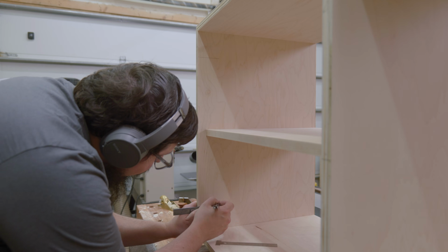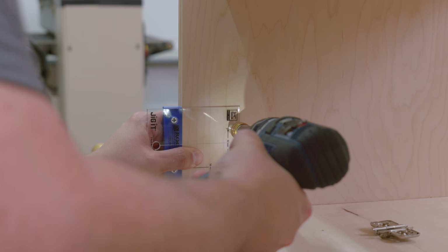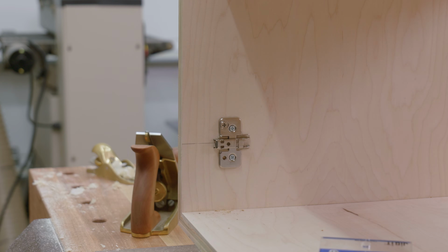Next, it was time to get these doors hung. So to do that, I'll just use a couple of jigs to attach my Blum soft close hinges. Now, if you guys are curious about the jigs that I'm using here, I'll leave links to them down in the description so you can check them out.